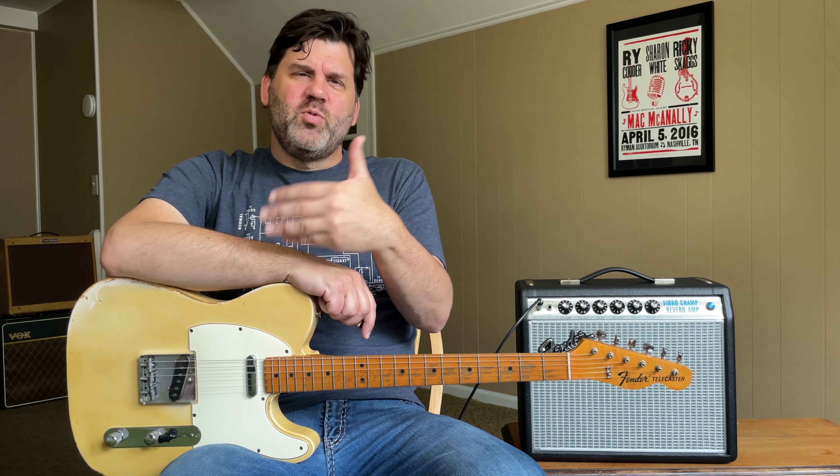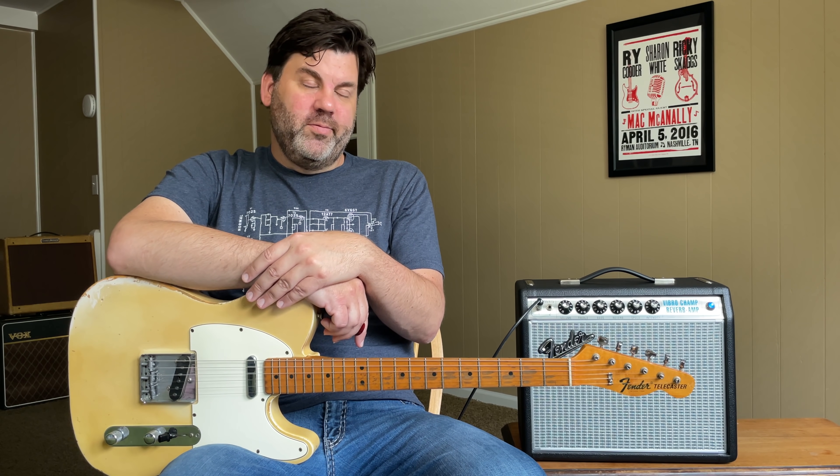When Fender changed hands in '85, you get the red-knob Champ 12, which had a 12-inch speaker and 12 watts. Then there was the weird hybrid Champ SE 25, which had a solid-state preamp and a tube power amp with two 5881s and 25 watts — really interesting amp, very short-lived. Then the Champ name was used for some transistorized models. Finally we get the tweed Champ reissue, the Clapton Vibra Champ — still tweed with top-mounted controls — but this new amp is Fender's first foray into the forward-facing tube-era Champ style, basically from 1964 through the early '80s.